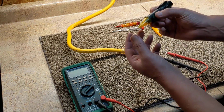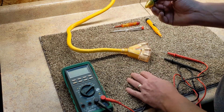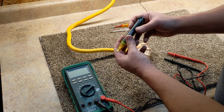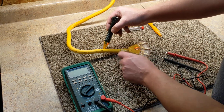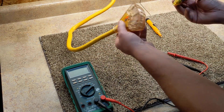The convenience of these — and they're very sensitive, which is good — is a huge plus. One of the negatives is if you have a couple of wires right close together and you're going along and one is hot, the wire right behind or beside it will also read hot because it's so sensitive to proximity.